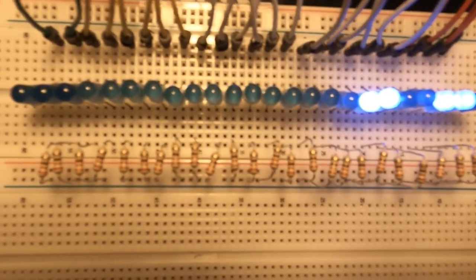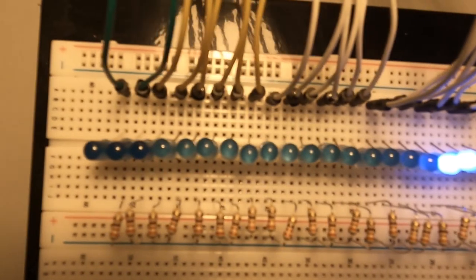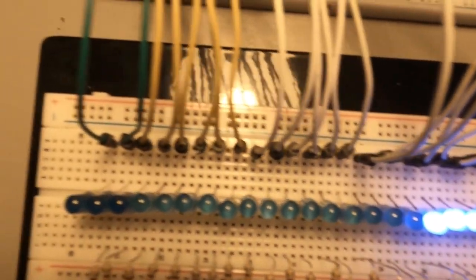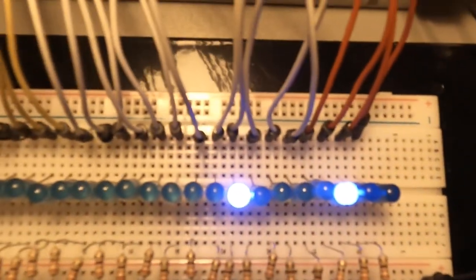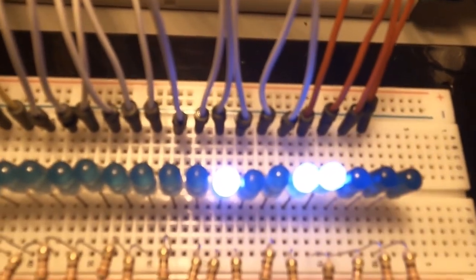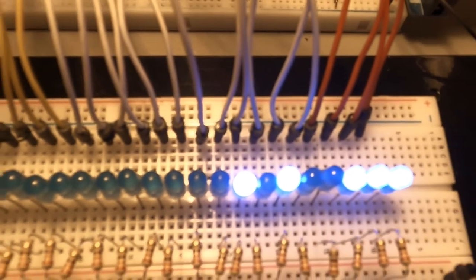And it's a simple thing to set up. All you need is 220 ohm resistors, your lights, 24 LEDs, and just use your shift register cords on each LED is all you gotta do. Just like before, going from right to left, going from Q0 to Q7 on each shift register. So there's 8 times 3, which is 24 LEDs on here. And that's all you gotta remember.